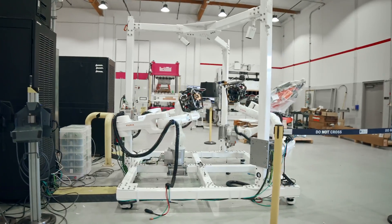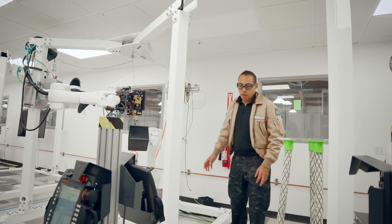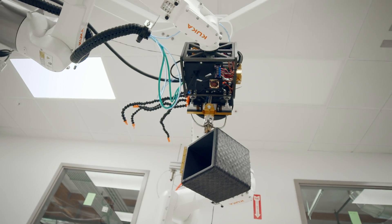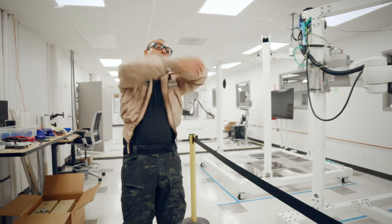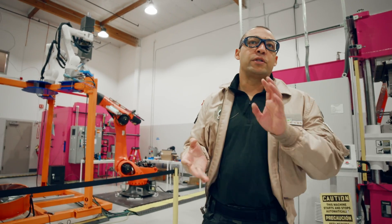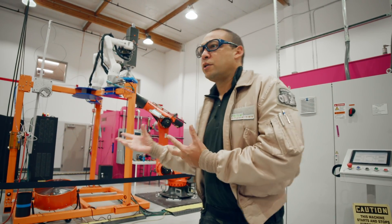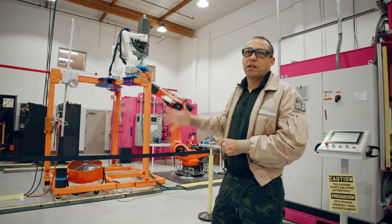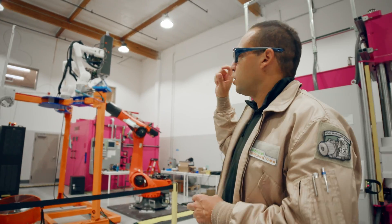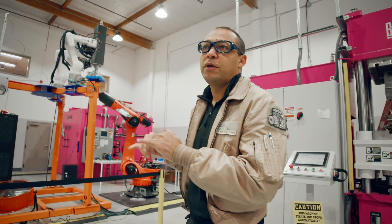These are Orbital SLs — big cage-like structures where the robots are in clamps. We can reposition different things around in order to build the printer around the parts we're making. That allows a great degree of flexibility, and you can use a small robot to make a big thing because the ergonomics of motion are enabled by the monkey bars, if you want to call it that. It's the same fiber, the same plastic, the same materials, the same tools — just a different size of robot. We really want to look at the robots like Legos. We're showing a 12-degree-of-freedom print — really 18 degrees of freedom; we're only using 12 right now. We have the big robot actually moving the part, but we could freeze the part and move the tool, and those can also move at the same time — that's when things get exciting.